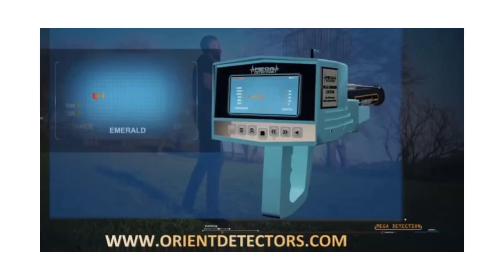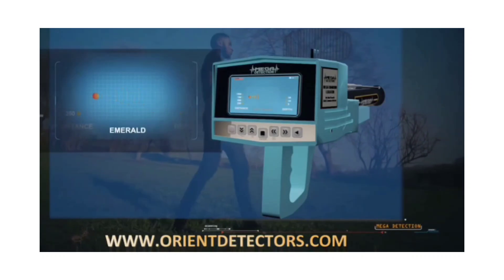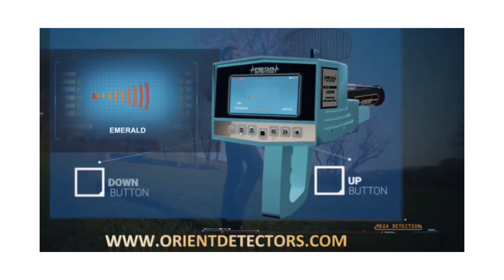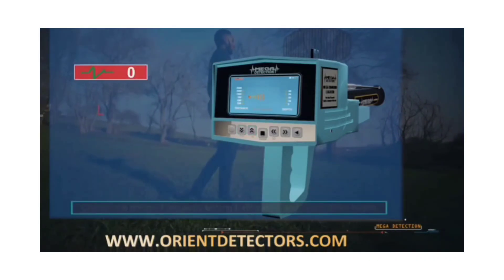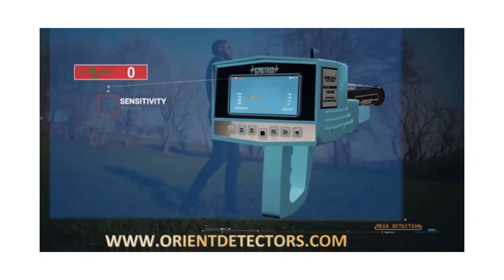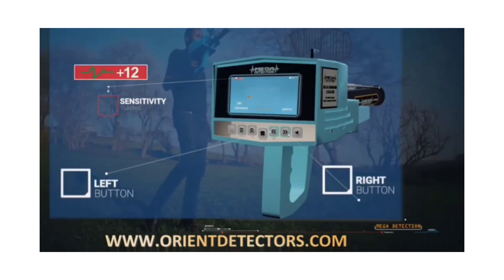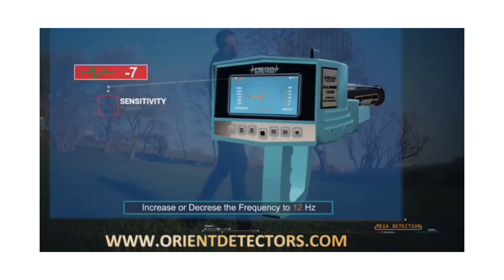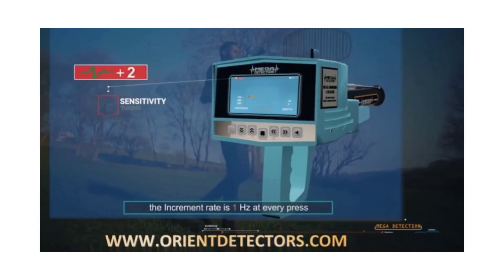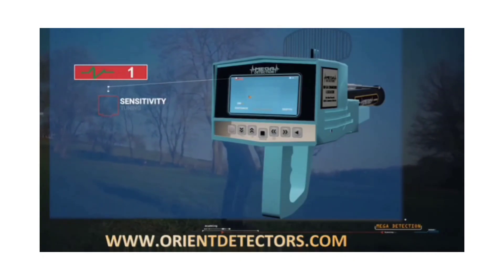The name of the program we have chosen shows a table of distances and depths. Switch between distances and depths using the up and down buttons. You can change the precise frequency setting by pressing and holding down buttons until hearing a different tone, then changing the value with the right and left buttons. The user can increase or decrease the frequency up to 12 Hz, with an increment rate of 1 Hz at every press. It is preferable to leave the precise frequency on the factory default at zero.